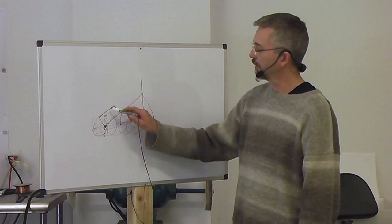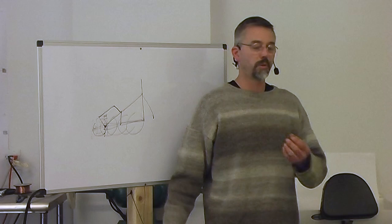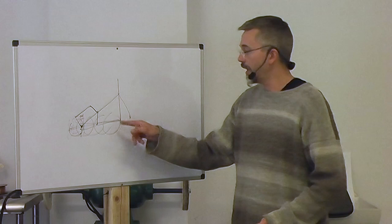So I take my compass and I walk it. Okay, it should be exactly that long. So you have no limits to quarters of inches or half millimeter. You can work to exact size outside the limit of numbers based on geometry. And if this says, well, that makes the hilt way too long in proportion to the blade, then you just vary the number of circles and get a shorter grip or a longer grip.